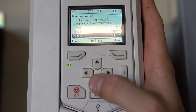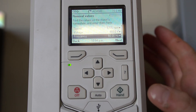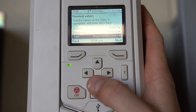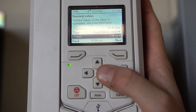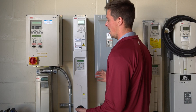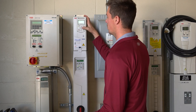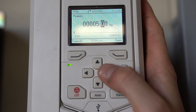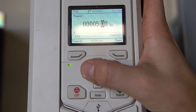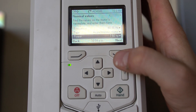Voltage: this is a 460-volt drive so we need a 460-volt motor — we don't need to edit that. Our frequency is a 60 Hz motor — we don't need to edit that. The type of motor is asynchronous or induction — we don't need to edit that. Our power is seven and a half horsepower. This is a 7.5 HP drive; we're going to match it to a 7.5 HP motor, or if it's smaller, say 5 HP, you can take it down to five horsepower. For now we're going to leave it at 7.5 — hit save.